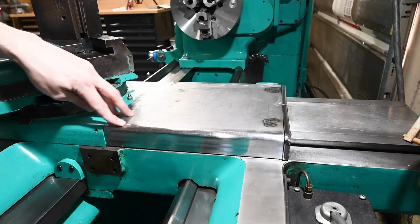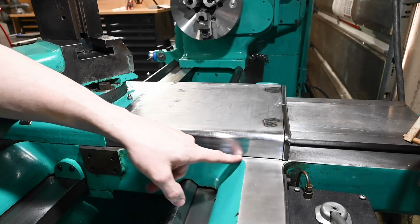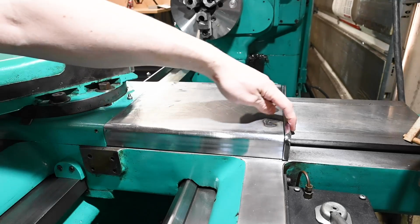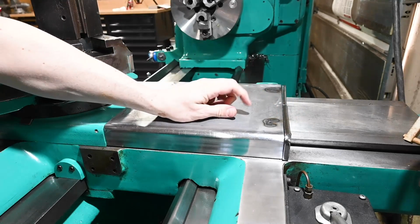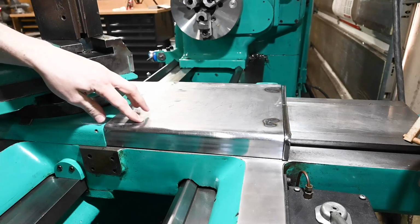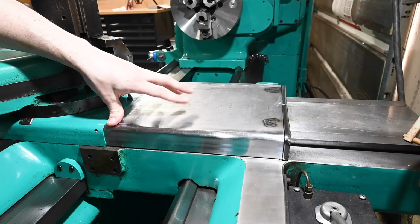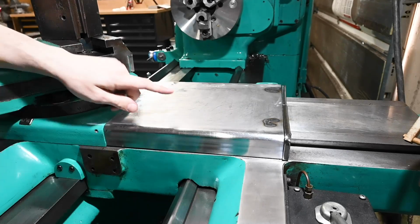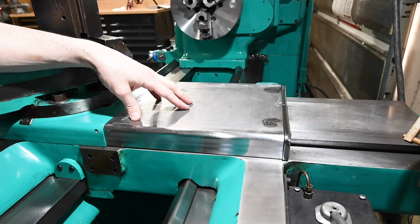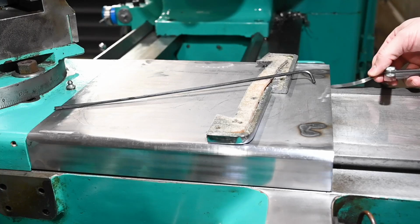Feels a lot heavier than I would expect it to, so I think there's some rubbing going on. I think we've got plenty of clearance on the sides here, but what it may be is that one of my replacement wiper carriers is rubbing on the top of this, or somewhere else is rubbing. It may be kind of pinching on that wiper carrier and the wiper material. So we'll take the end off and then take some measurements and make sure there's nothing dramatically off, and then we can start prepping this thing to kind of finish it.